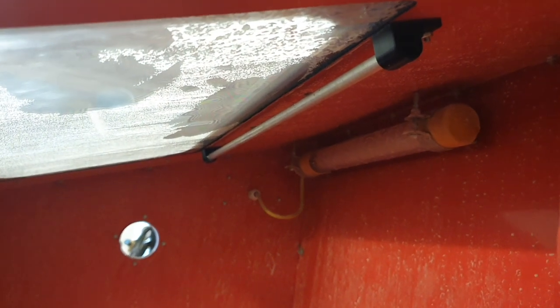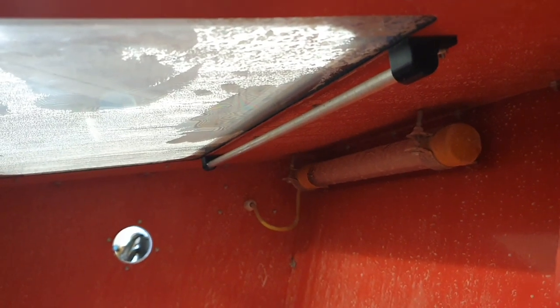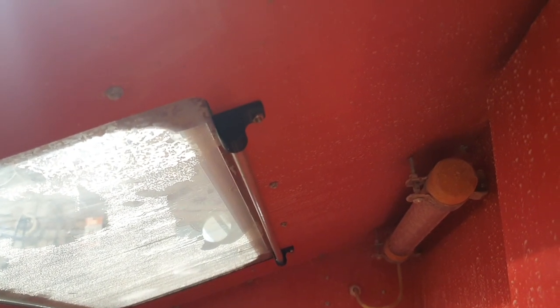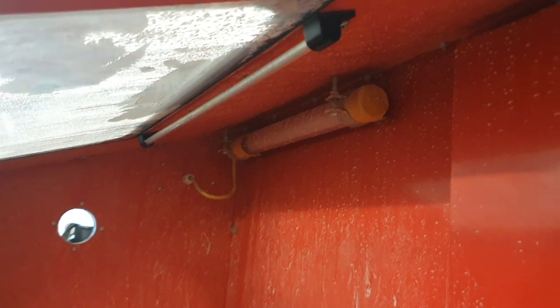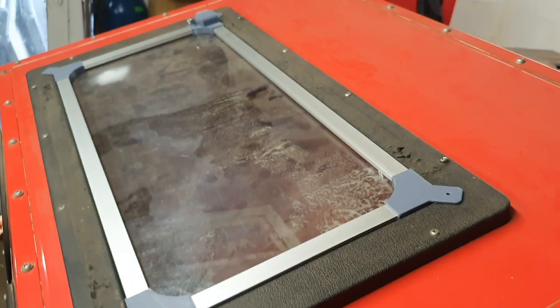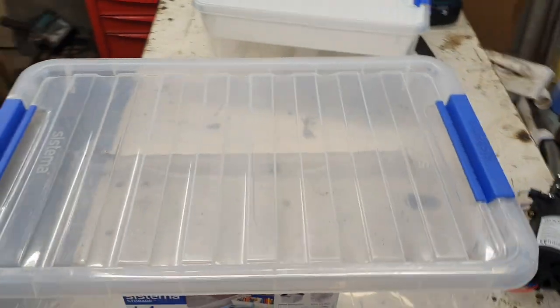If you look in there, that's it — two 3D-printed end caps and an aluminium tube with some holes drilled in it. The mounting points are just the ones that come through from the window bezel, so you put a couple of longer screws on the two ends and the whole thing bolts together. Super simple, no modifications to the cabinet — just swapping out these two screws. As you can see, that's the old screw type, and it's just got a longer M4 cap screw in it.